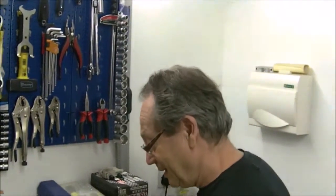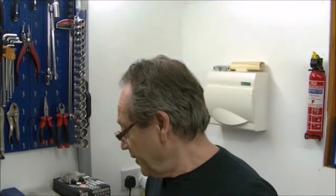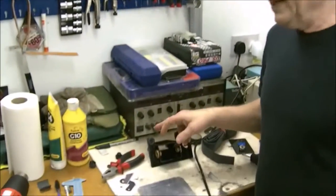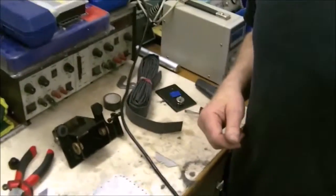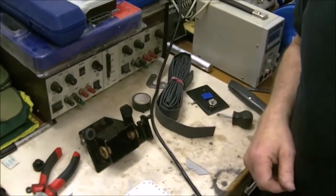Do you know what the N power is per pound or per kilogram? No, all I've been able to do is, on the various sites that give you a chart, I simply looked for the most readily available, most powerful version. The other thing to remember is specify a pot magnet, not a conventional magnet, because the potting that surrounds the magnet, at least to a certain extent, stops the magnets from shattering. And believe me, when you're playing around with these, it's very difficult to keep away from anything metal. Look, I'm not being rude. What you know is about my fingers. Can't say no more than that. End of lecture on magnets.